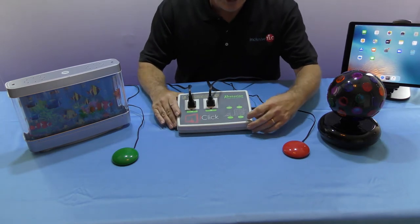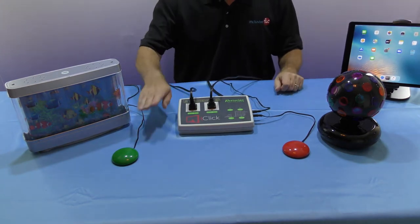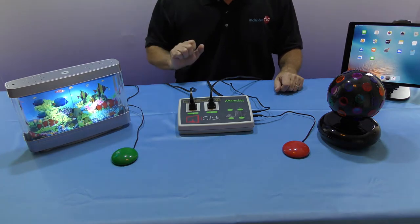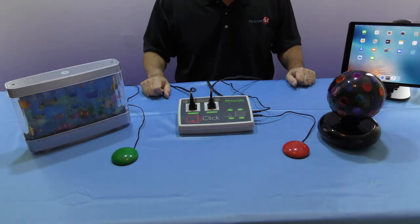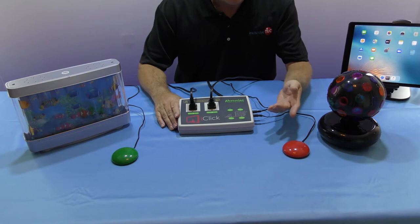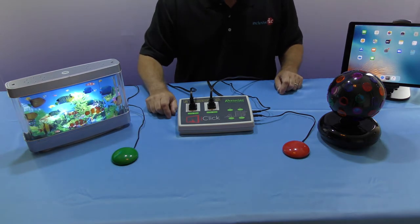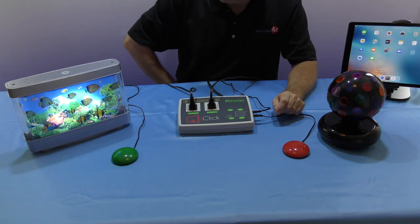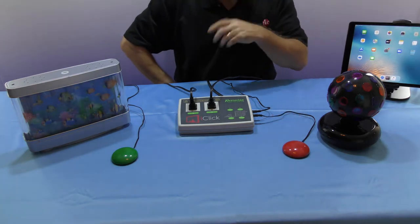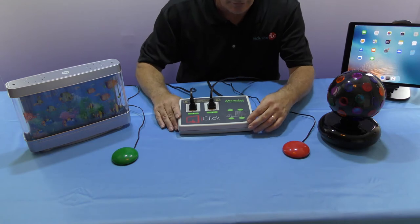You can see it's very simple. If I move to latched mode, I press my switch now and it will continue to run until I press my switch again to stop it. In seconds and minutes modes, it will just work for a certain period of time and then stop - these are very good for cause and effect activities. It stops, and you encourage the user to press the switch again to get more reward or stimuli.